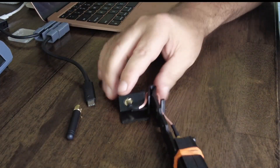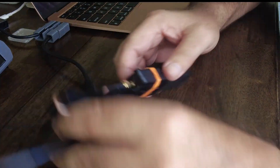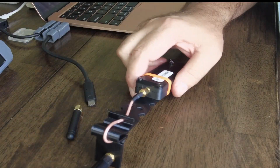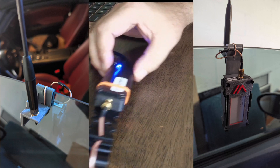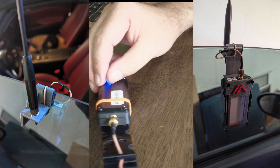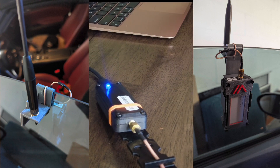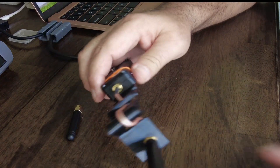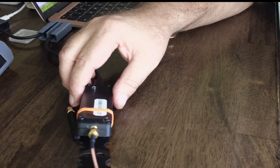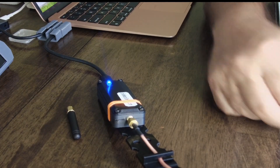And there you have it — a mobile node that I can now put inside the car and clip onto the window, as you'll see in the pictures. In this little mobile node I've added an LED that shows it's on. So that's a complete mobile build. You can power it from your USB port. Other nodes might have batteries in them, which makes it even nicer because you don't have to run a USB cable. With the antenna on the outside and the node on the inside, I have picked up so many more nodes while driving. It's really been a game changer.